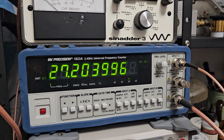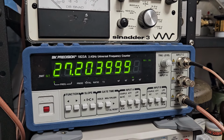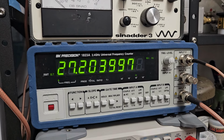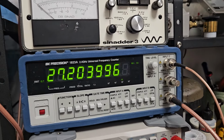Yeah, all in all, it's in really good shape. So this is sideband frequency. This is lower side on channel 20. So that's really good. You got the 1K tone bringing us down one whole kilohertz down. But yeah, that's nice. Obviously when I open the lid up, things are going to change. So that's to be expected.